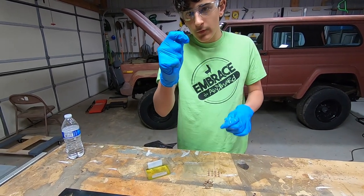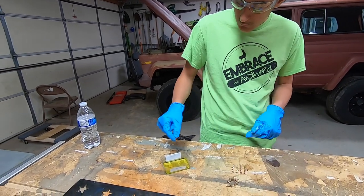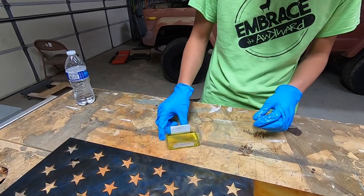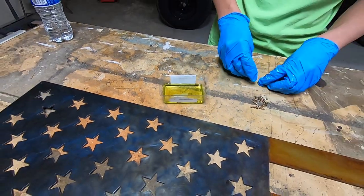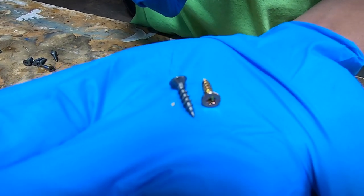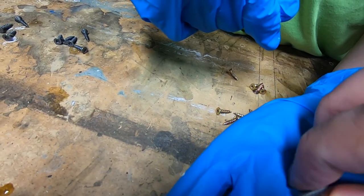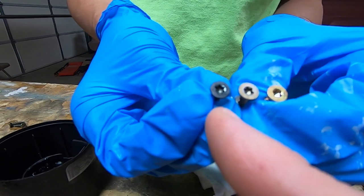The screws don't really look very good compared to the flag — they just seem too new, too shiny. So we're going to give them a couple of chemical treatments. First thing we're going to do is dip them in some muriatic acid to remove the goldish coating on them. Oh wow, there's already bubbles — don't breathe this stuff. About 30 seconds in the acid bath and it took all the coating off. Then we blued them — this is the original, this is after stripping the coating off, and that's after we blued it.